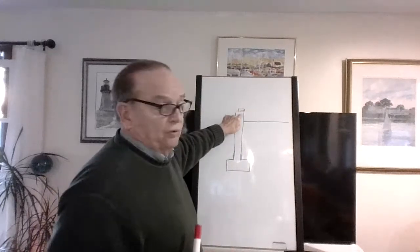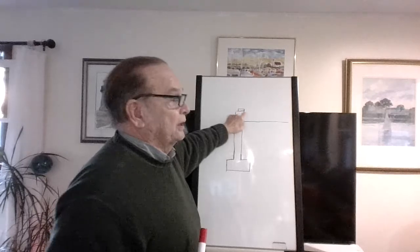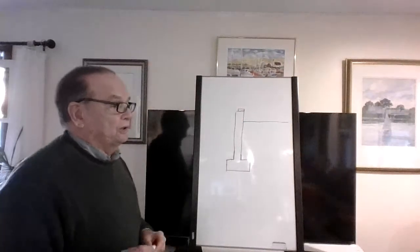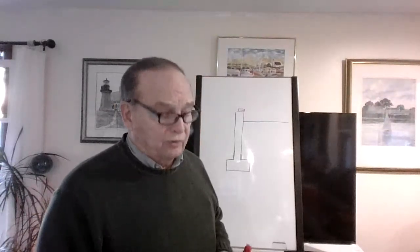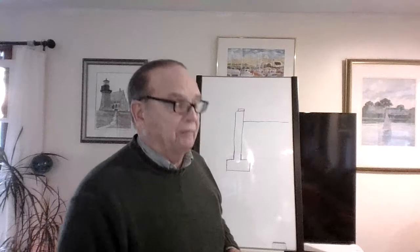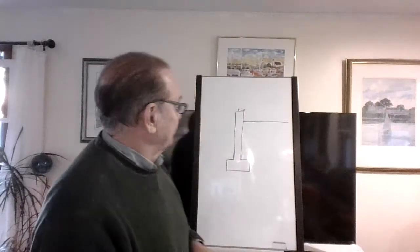This is a huge improvement, right? To keep out the cold and the drafts, the sill seal. And some of you said you use it to wrap a pipe when you're going to have concrete poured around it, to protect the pipe from being encased in concrete. That's dangerous because somebody could whack it before it's poured, before you have a chance to cut the pipe down, and you've got a nightmare dealing with it because you have to chop into the floor.